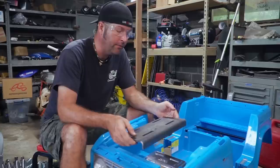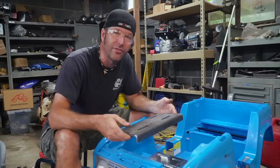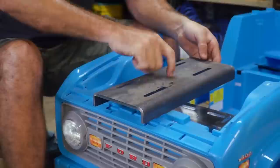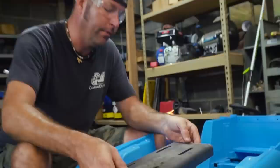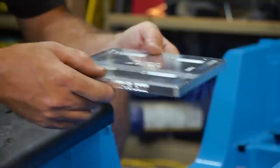It's time for an engine plate for this thing. We need to figure out where the engine plate is going to go and how it's going to mount on the chassis. This one is heavy duty, which would be awesome, but it's extremely heavy. If you wanted to put a bunch of horsepower down and you don't want anything to bend, this is the way to go. But we are going lightweight with this. I'm kind of leaning towards this engine plate — it's way lighter and way adjustable. It will adjust forward and backwards and side to side, which is going to give us plenty of wiggle room with our engine.